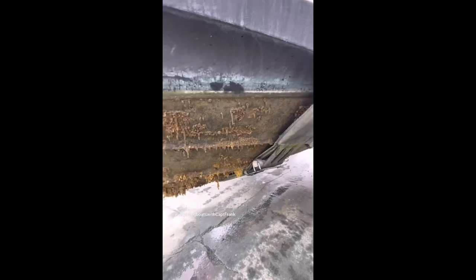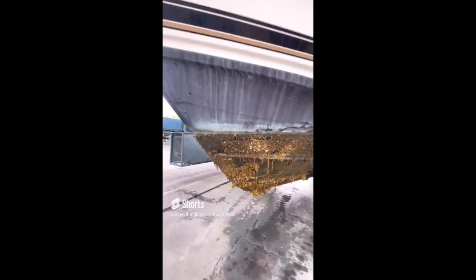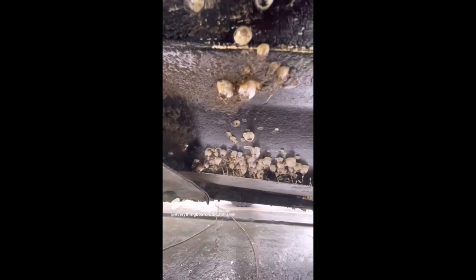Here's a good reason why you always want to have the boat hauled and cleaned before conducting your sea trial. As you can imagine, all this growth on the boat would affect the boat's speed and handling. The purpose of the sea trial is to make sure it accurately reflects the boat's handling and speed, which is why you conduct the haul-out before the sea trial.